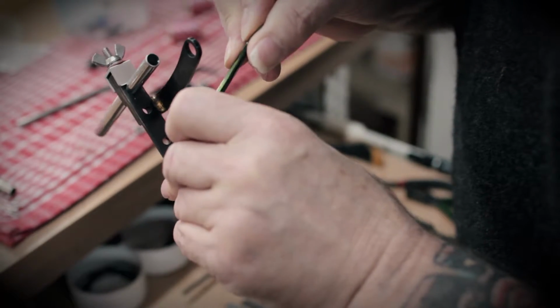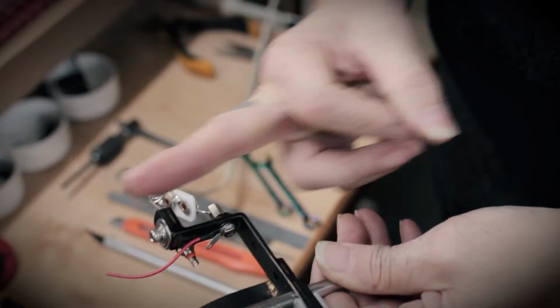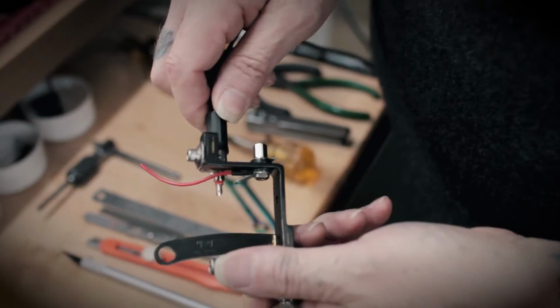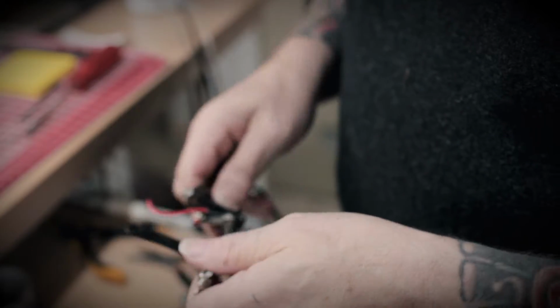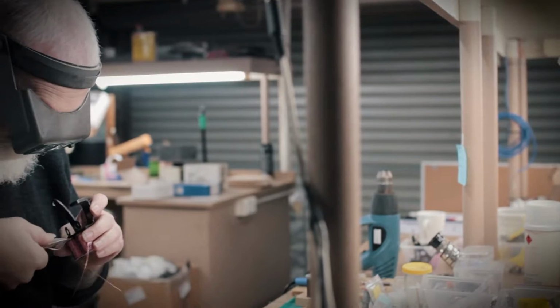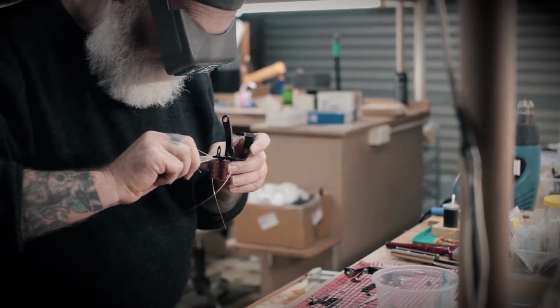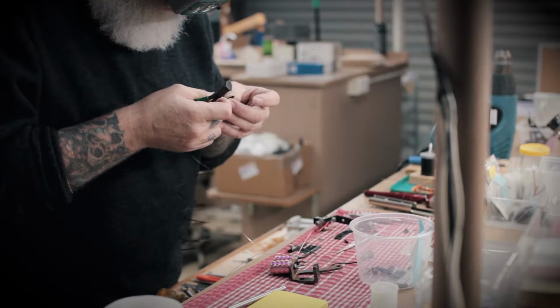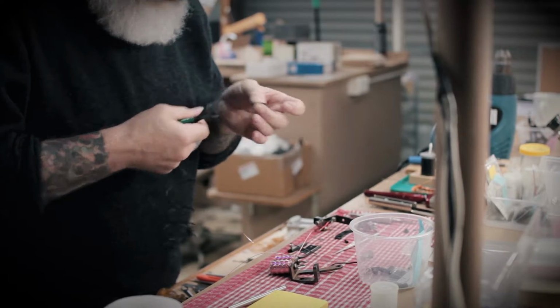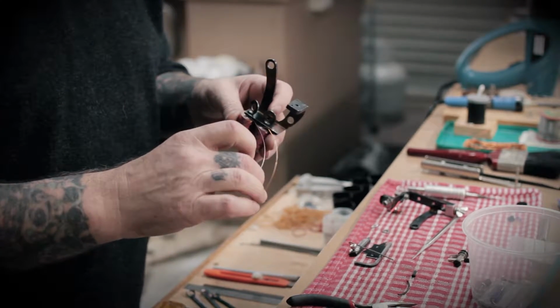This particular customer wanted a machine with a dual connection, which in this case is a clip cord and RCA. Colin had to create a bracket in order to work out the electrical elements to go into his machine. Given that this machine is hand built, he has no templates for some of those pieces. So he'll trial and error and ensure everything fits together. He checks the alignments, measurements, and for any interferences that might occur during the assembly.